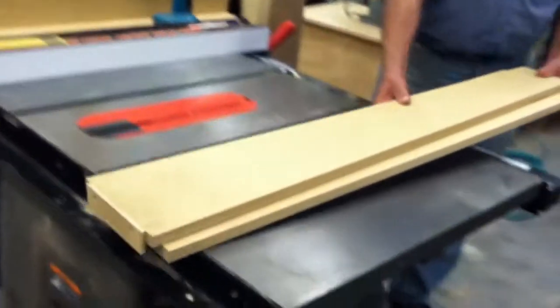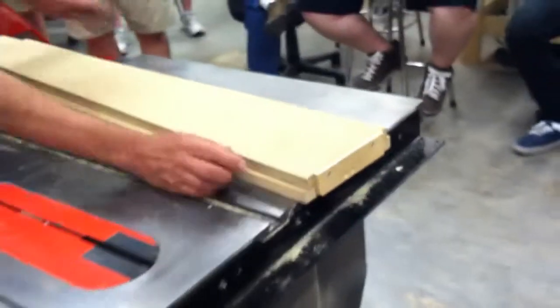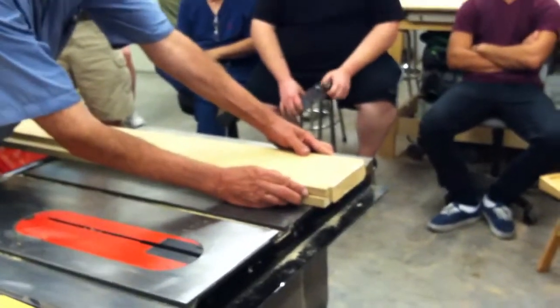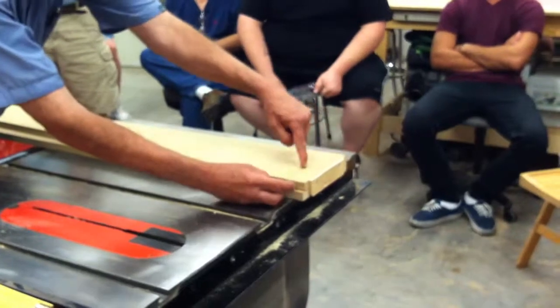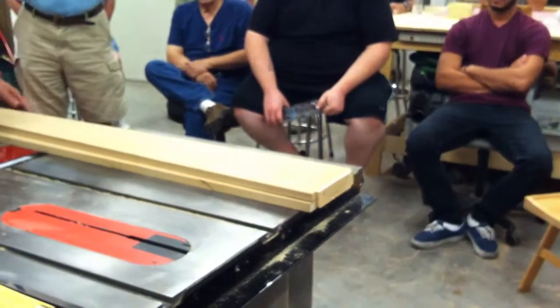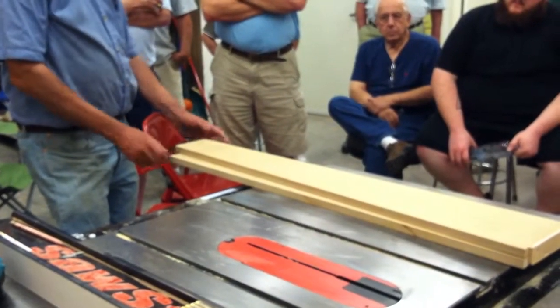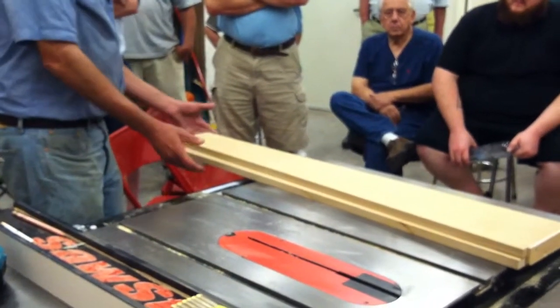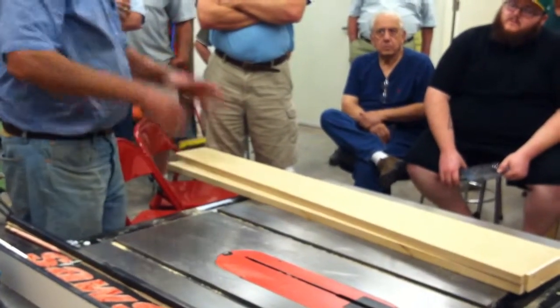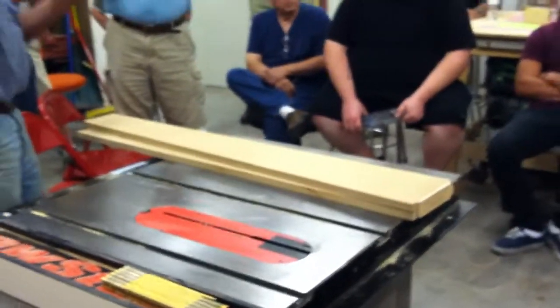This piece is actually short, but what I'm going to do is show you — this screw is on like so, and you've got to make sure that this is centered. This is 7½, this is 7, so you'd have a ¼ inch here and here, and then put a screw in. This is 4½, 7½ — you have an inch and a half here and an inch and a half here. If you do any of this stuff, just make sure your templates are lined up right so that all your pieces end up matching.